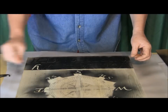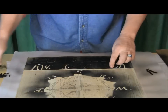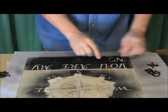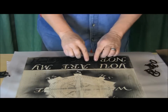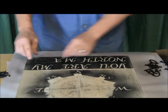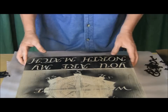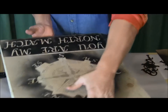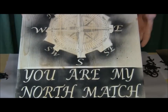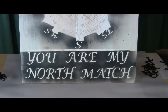Paint tends to bleed into the board a lot worse than ink does, and it tends to gum up your sanding belts when you go to sand. So those are the two. Yeah, the paint will soak in because of the carriers in the paint. It'll soak into the grain, especially on pine. It's impossible to sand out. And even if it didn't, if you use it on some other wood like redwood or cedar, which it will work on, it'll gum up your sanding belt.